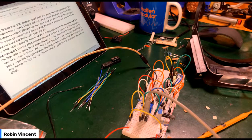And my other question is that I don't have a 4K resistor. And that's supposed to be doing the thing that does the divide down 25. So I'm using a 14K resistor, which is not doing the same thing. So my range is not going to be as great, I don't think. And so maybe that's messing me up. So this 4K resistor, does it mess up the tuning?